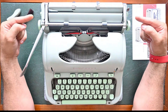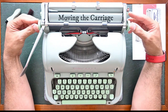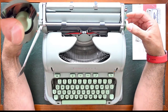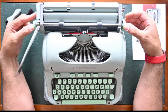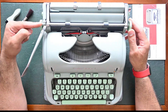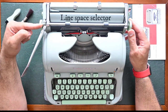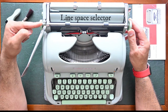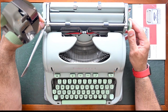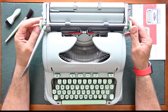To move the carriage you can use the buttons on the left and right side. You press it and the carriage will move, and same applies to the left one — it will release the carriage if you keep pressing it. To select the amount of line spaces you need while typing you use the line spacing selector. There are three options: one, one and a half, and two. Use the small lever on the left side to adjust it and move from one line spacing option to another.